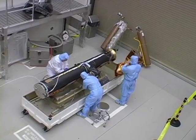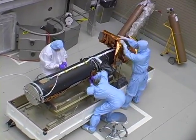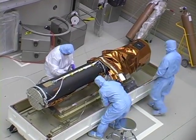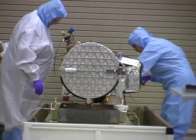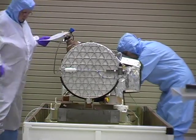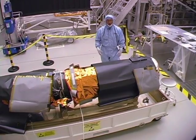As far as the thermal protection is concerned, the blanket is quite a useful feature to prevent heat loss and vice versa, heat from coming back in. But we also have other ways to provide thermal protection, which is to give a surface property finish or thermal coating. For example, our front door has relatively low absorptivity in the solar range to minimize sun being absorbed. Our instrument needs to be maintained at a fairly constant temperature around room temperature, namely about 20 degrees Celsius.